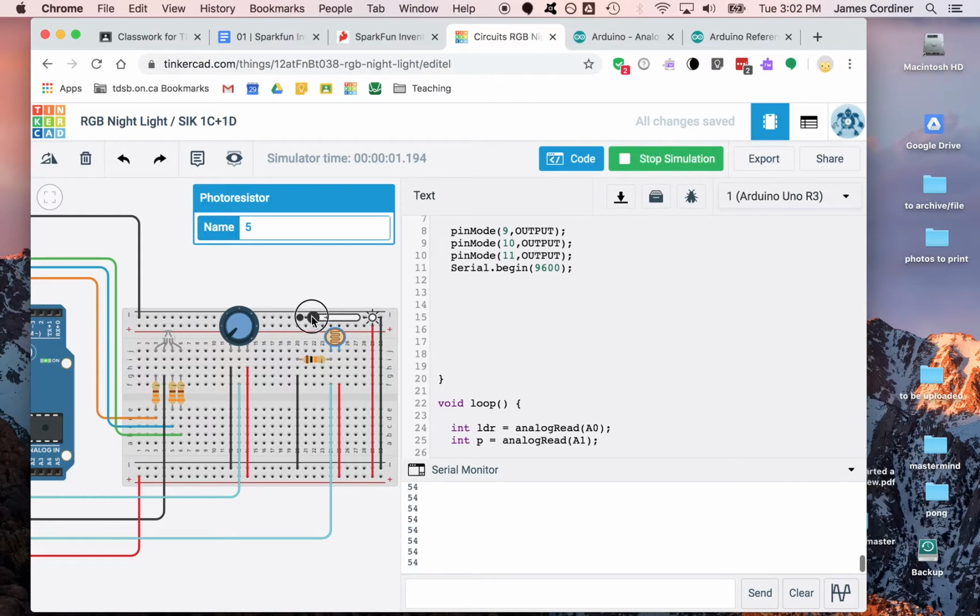So almost nothing on analog read, and it should edge gradually up to 1023 as we get up here. Now maybe we can't quite get to 1023 because there is some resistance here, right? So we can't fully get to 1023, like we can't fully get down to 0. There's just a bit of resistance here that we can never make fully go away. Like on the potentiometer, when we turned it this way, this was almost 0, right? But this is fixed, so it's never going to go away. So we have a boundary on either side. But this is a voltage divider in action.